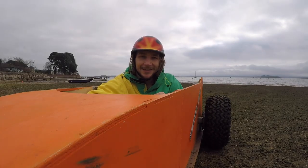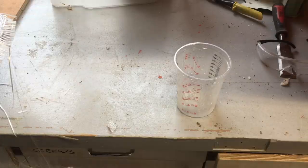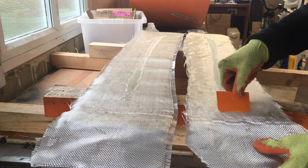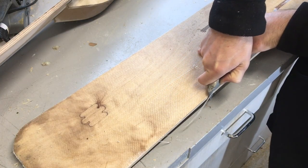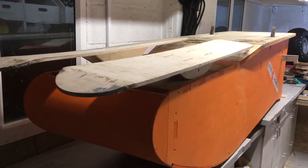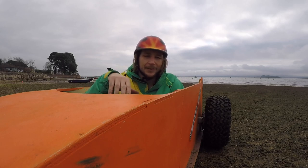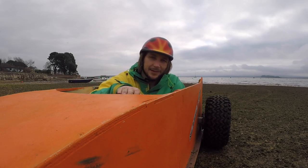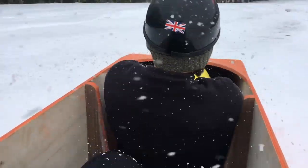When I made those skis, I steam bent them just to form them, to give them a bit like a snowboard, the way it's slightly curved. And then on the front, on the nose of it, so that it lifts up so that the snow doesn't get caught. What I found, that doesn't work at all. They're not big enough. I really should have had just one big ski at the front that could tilt left and right. The problem with this flat bottom bobsleigh is that it's really hard to steer. So when you're turning, nothing much happens, but that makes it a bit more exciting.